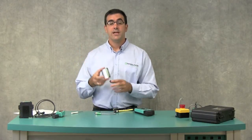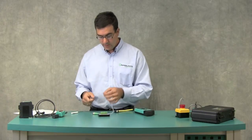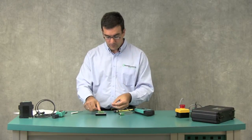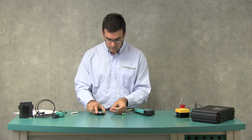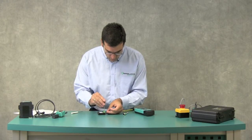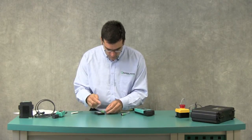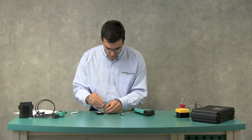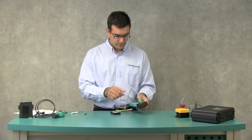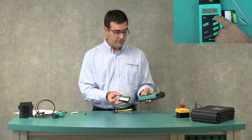The next one is a module which has no addressing jack and no M12 connector — it just has terminals. So I'm going to use the cable with the flying leads. Brown is ASI plus, blue is ASI minus. Attach this to the handheld. I'm going to arrow up to address 4. Because it has extended addressing, it will actually make it 4A.